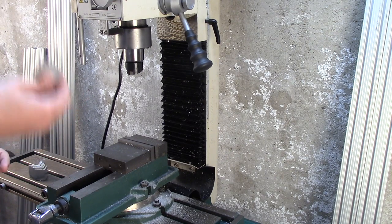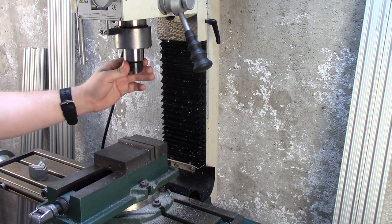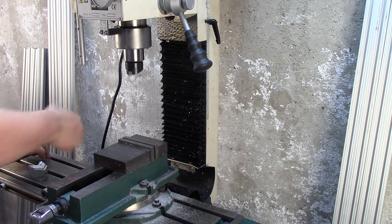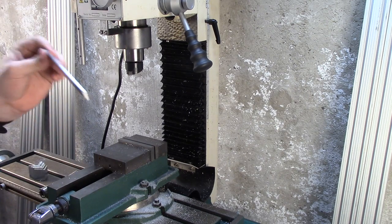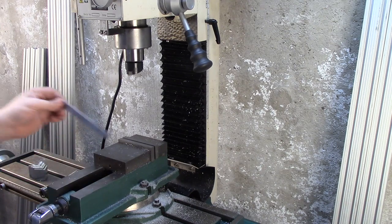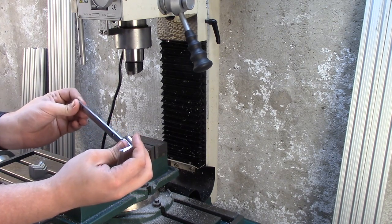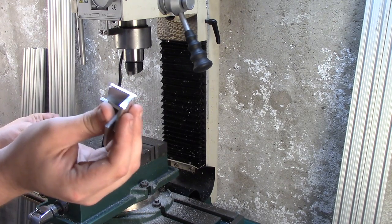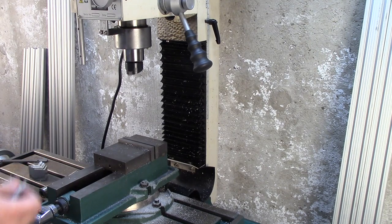That kicking of the workpiece, I think I could have gotten away with it with the fly cutter, but what you actually saw was the flat that I was using in the vise was getting pinched before it was clamping these. So it was only lightly holding on to the brackets.